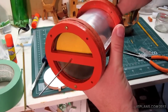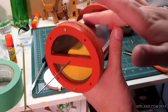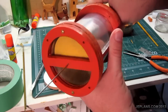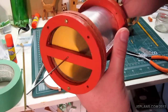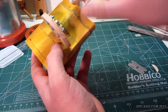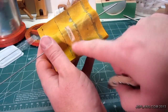Testing out the displacer inside the displacer cylinder. I'm going to have to balance it in the center of the displacer — I didn't really plan on that ahead of time in the design. But if I don't do something, when it spins this is going to wobble so wildly if the engine runs at any speed. I decided to add in a counterweight in the middle of the displacer. I was going to put it on the end, but that would still cause the engine to wobble. So I notched it out with a carving knife.